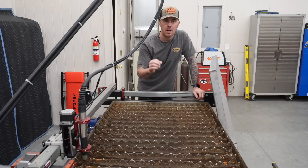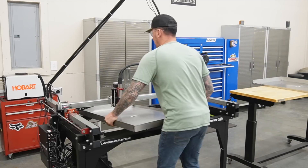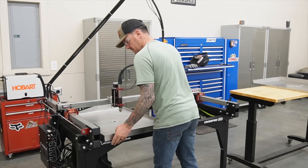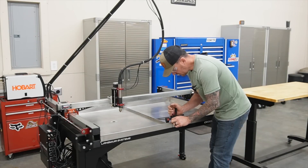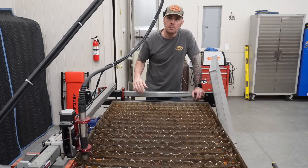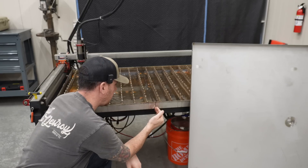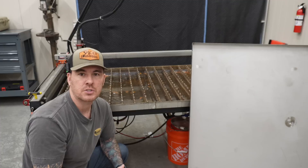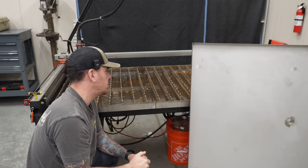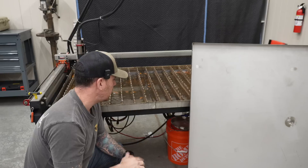If you're watching this video you probably have a Crossfire Pro yourself and you already know exactly what you're working with. It is a two-piece table, not much larger than the actual cut dimensions of the torch, and it tends to have a lot of water splashing over on the edges — sometimes it can be a bit of a mess. Being that it's a two-piece water table, you have this seam right here down the middle all the way across and it's pretty prone to leaking.